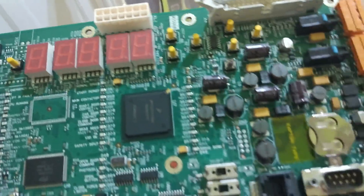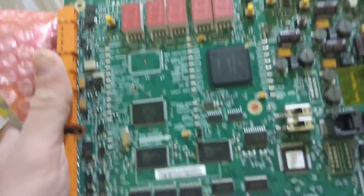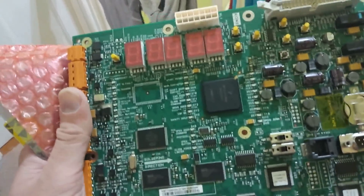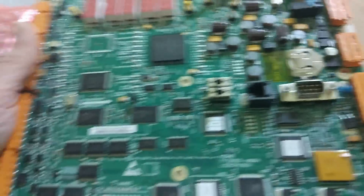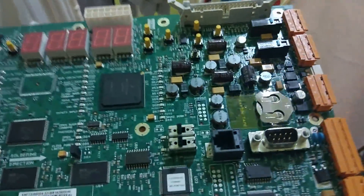But there's menu 4 — read-only settings. You can only alter menu 4 directly through the serial port; you can't alter those settings by pressing the buttons. And there's the most important setting on the EcoDisc — the right piss-take setting. As much as I prefer real lift companies over generic ones, when a real company does something wrong I have to call them out. Kone has done something completely disgusting: it's the setting of how many trips the EcoDisc has done. When it's over 10,000, the menus are locked, so you cannot do anything through the buttons — only the serial port.